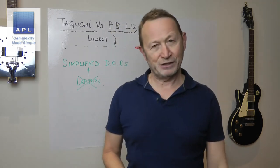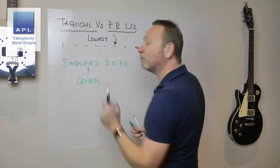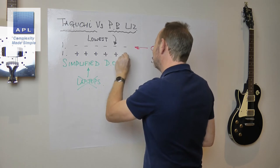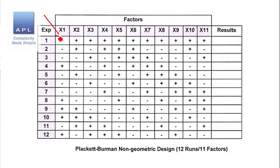There's also another version of the Plackett-Burman L12: it's the same way up as the Taguchi L12, but row one in Plackett-Burman is everything at the positive. In fact the whole pattern is a completely opposite pattern — every high setting is a low setting and every low setting is a high setting. It's a complete mirror image. This is the first time I've seen the Plackett-Burman like this, as just the mirror image of the Taguchi L12, with the top row all positives instead of all negatives.